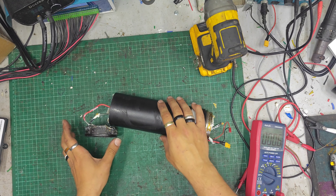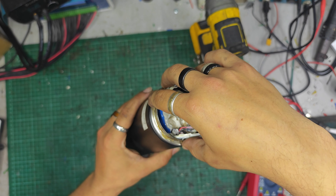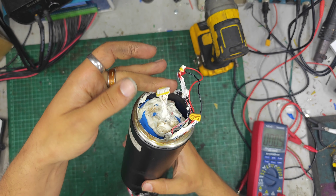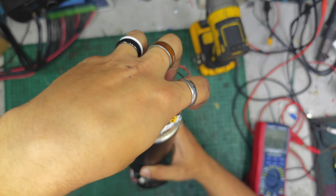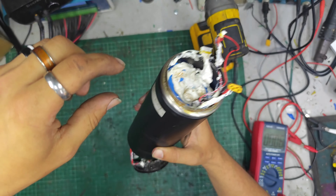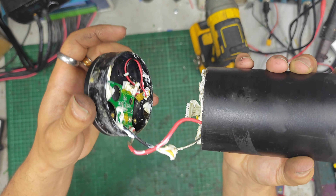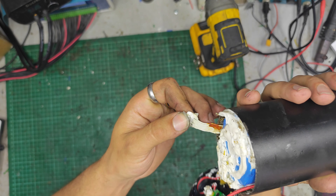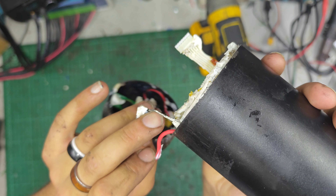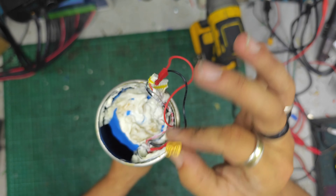We're back at it with a few more developments. The top came off fine. The Bluetooth module is not in here — it's in the base unit of the bike. So that's what this comms port wiring is for — it goes from the top of the battery pack down and out, connecting via this JST connector through all these pins into the rest of the bike. Now the bottom does come off but it was so glued on — an absolute nightmare. All this was horrifically attached. The insulation on the wire got stripped so that'll need replacing, and the insulation on the positive got stripped too.